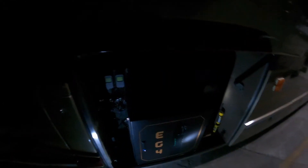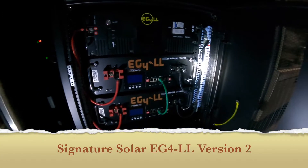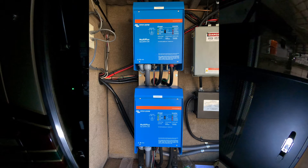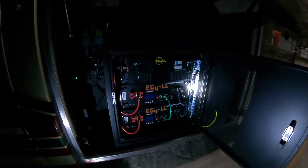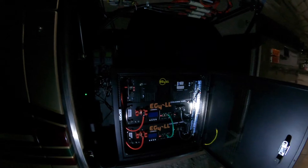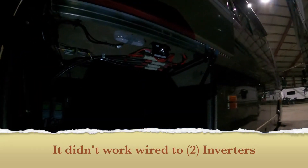Now I'm trying to get this to work to start my Victron inverters. I've got two batteries down below and one up here. When you turn the battery on, the inverters have large capacitors — I've got two running in split phase — and it creates a dead short, a huge spike, and the battery's BMS shuts itself down. This top battery is supposed to have an internal pre-charge resistor, but it didn't work, and neither did the bottom ones.